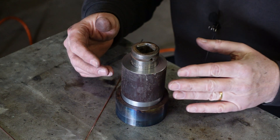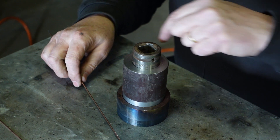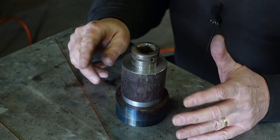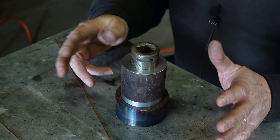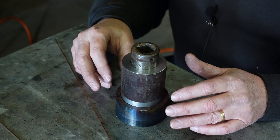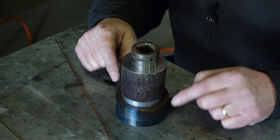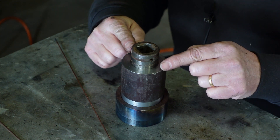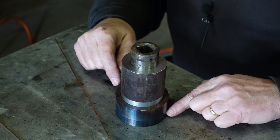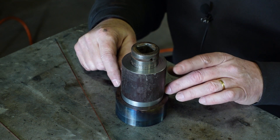That went surprisingly well. The socket is a nice press fit in there, and I'm going to go around with a bead of weld just to lock that in. The thermal fit down the bottom - in hindsight I probably could have gone a little more interference; four thou is only 0.1 of a millimeter, and the way it slipped on I probably could have done something like six thou. But it doesn't matter, it's done. I'm now going to weld that up, then put this back on the lathe, thin down the bottom, take the lip off, maybe shorten it a little bit, and I'll see about putting a bead of weld around there too.